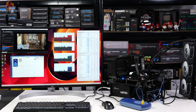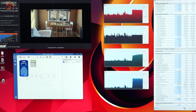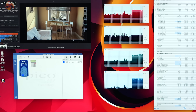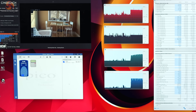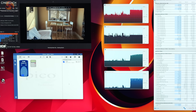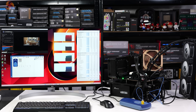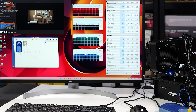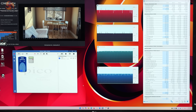Let's look at VRM operating temperature to see whether the heatsinks are up to the job. Our Ryzen 9 9950X draws 200 watts under load in Cinebench R23 with an ambient of 22°C. The VRMs start at 35°C and after 9 minutes rise to just 46°C — icy cool. Adding a Noctua fan to mimic a rear case fan, the starting temperature drops to 32°C and the peak to 41°C. The VRMs and their cooling system are absolutely fine.